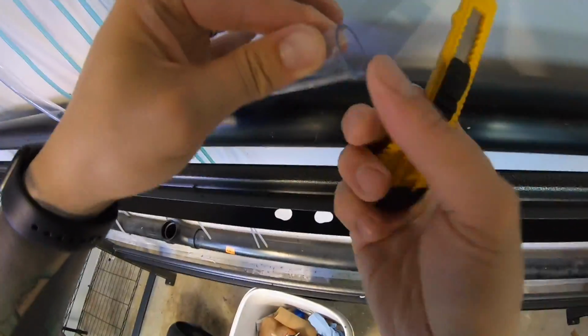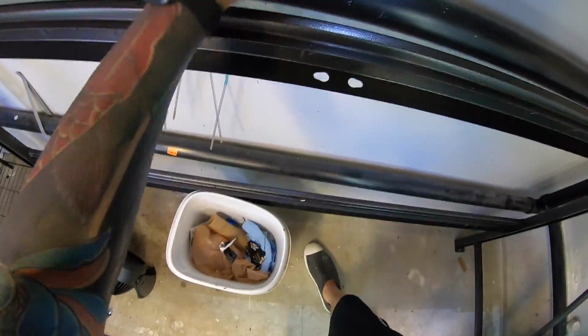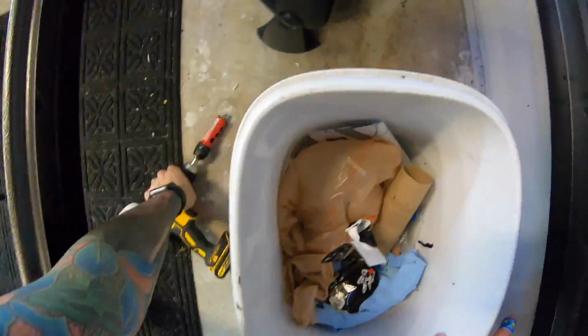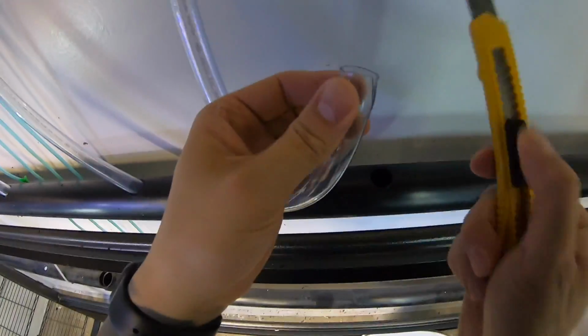And so right now what I'm doing is on that drain line, I'm just notching that drain line at the very end. So there's no way that it could possibly form any type of suction or get fully flush and stuck against the drain, the actual main drain line, that 2-inch black ABS. So that kind of gives me that extra layer, that extra security that that's not going to happen. And so now I've already drilled 1 or 2 of the drain lines into the 2-inch ABS. I'm using my trusty Diablo carbide hole cutter.